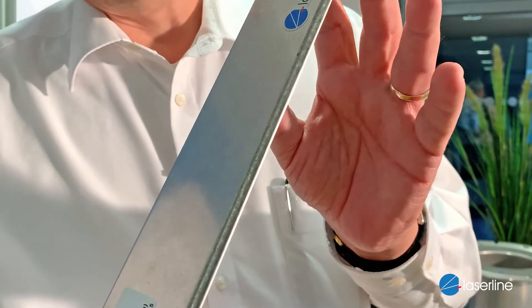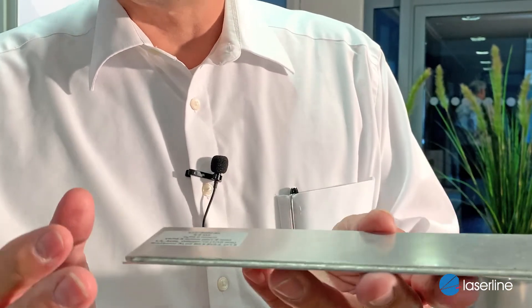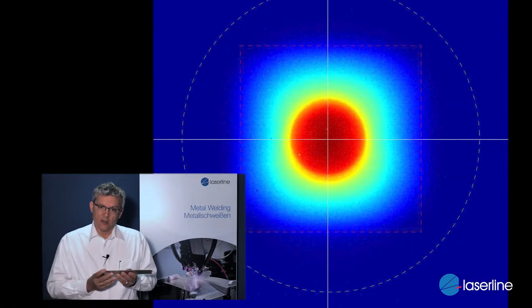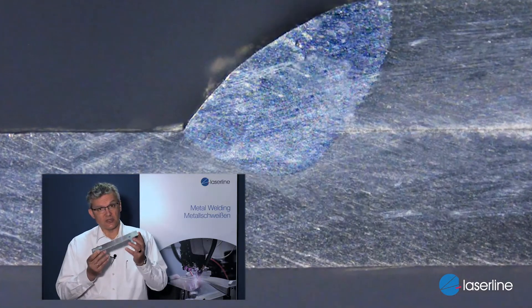Another example is this part here — again aluminium — where we are welding in the fillet, creating a very good surface. You can see the joint sections and the wonderful surface of these parts joined by laser, aluminium material, and filler wire to avoid cracking. A specific tool we use is spot-in-spot welding, which helps reduce spatters, makes a very good surface, increases speed, and overall gives a much better application. A center spot creates high depth and the surrounding spot smooths the weld pool — a wonderful tool for many applications, specifically in aluminium.